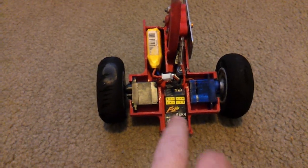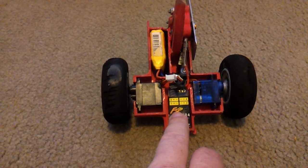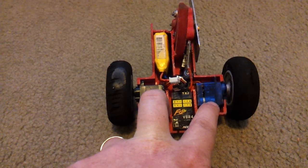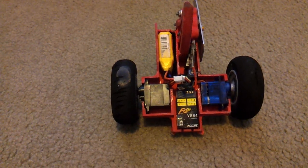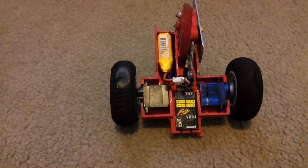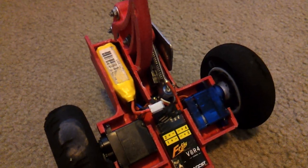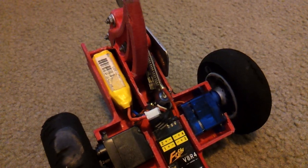Inside we have all the basic parts. We have a 4-channel radio receiver and two standard 9g hobby servos, which are being modified to run continuously. The wheels are attached to the servo's control horn, first with superglue and then coated with 5-minute epoxy.